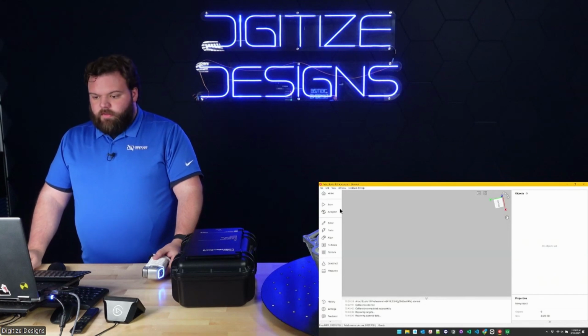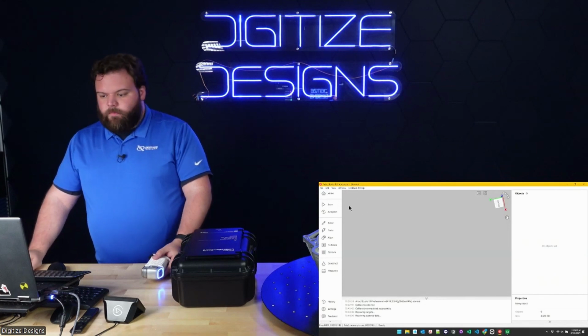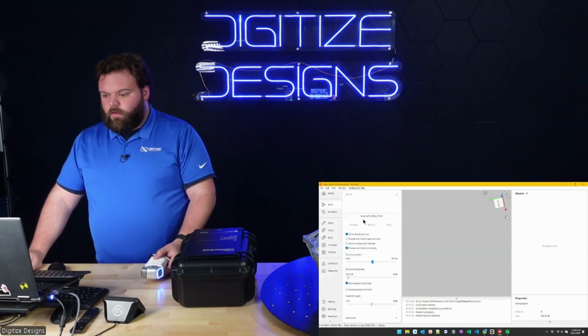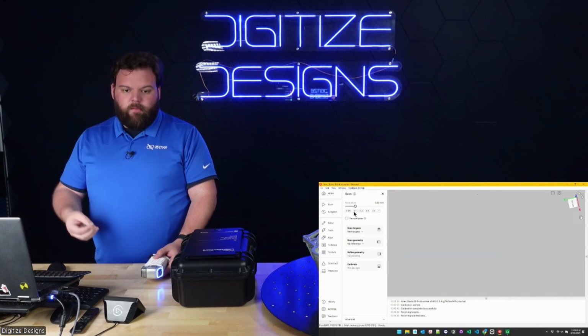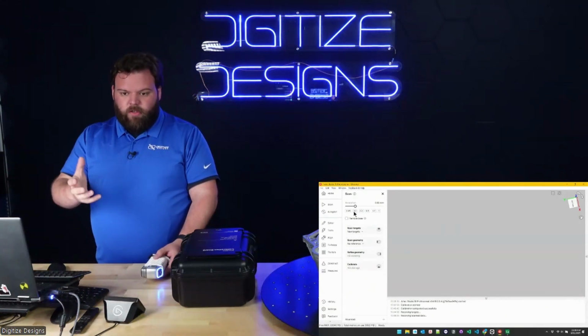Cool. Let's go ahead, I've got Artec Studio open. I'm going to come in here and tell it I'm ready to use the Point. I've got a really simple little scanning interface here. Just got to pick a resolution. Basically, resolution is how closely together it's going to space all the points that it's using to evaluate and to resolve your object in space.